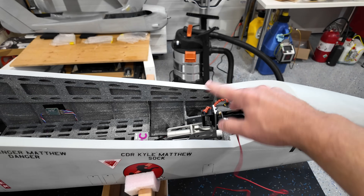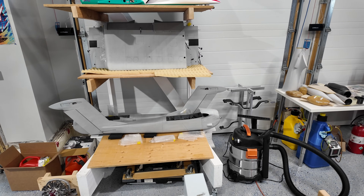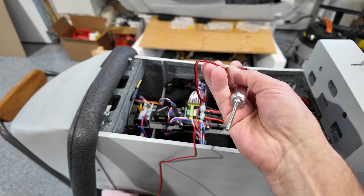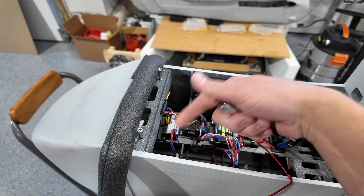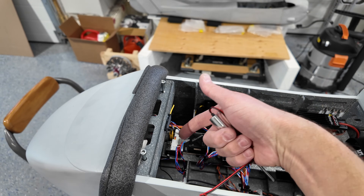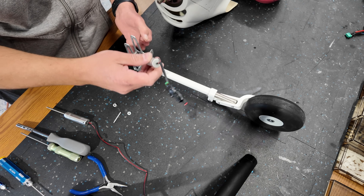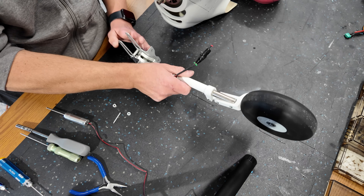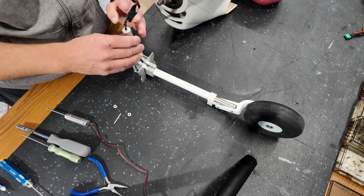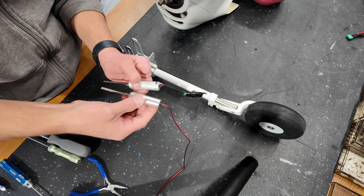We may need to trim this rod off a little bit because it's a little bit shorter. We're going to get these gear out — probably start with our nacelles since the nose is maybe a little bit trickier. We'll pull one of the nacelles out and start with taking those landing gear out and checking them out. We can also plug into the LGC22 and confirm with a bunch of cycles that everything works 100%. Changing the motors is fairly straightforward. You take the pin holding the back of the motor off and just unthread the motor. Here are the dimensional differences between the two.